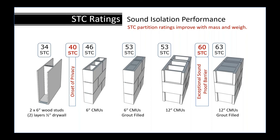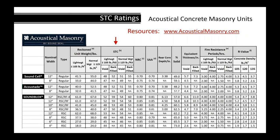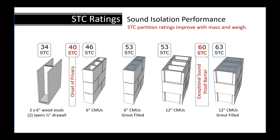You can incorporate this into acoustical concrete masonry. On the website acousticalmasonry.com — which is SoundSeal's — you can see the STC ratings for both lightweight and normal weight block, both as installed and with the back portion filled solid. You can achieve STC ratings of 55 and 60, which is towards the exceptional sound barrier range.